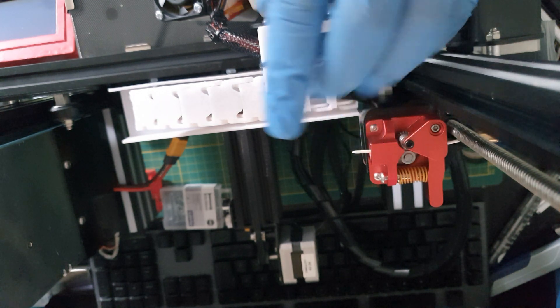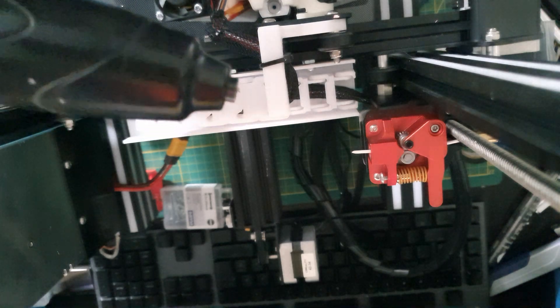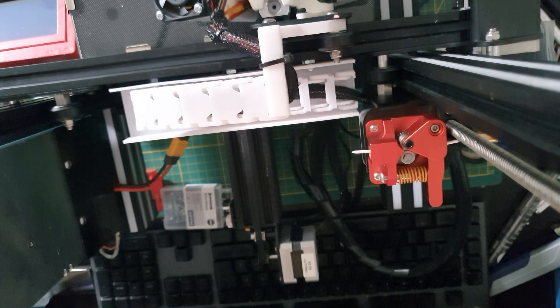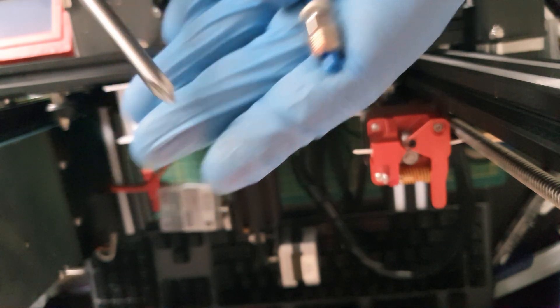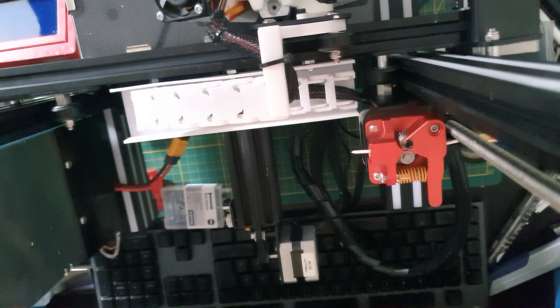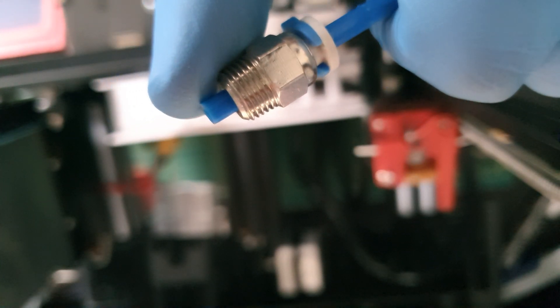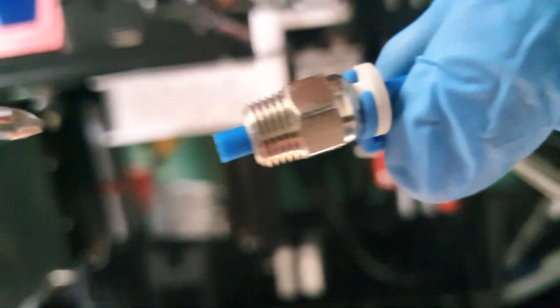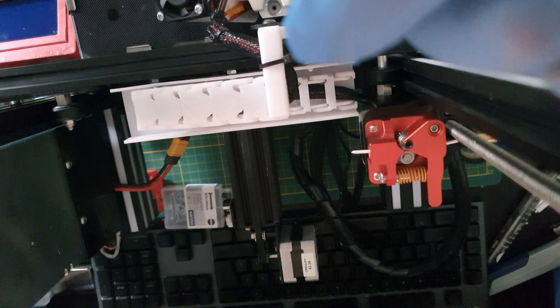Once those washers are in, that's that for that side. You will also need a little hand drill - you could use a regular screwdriver but the hand drill is way easier. You will also need a positive drive bit, quite a chunky one. What you will do is put on the clip once you've exposed about five millimeters or one-fifth of an inch of tubing, then spin your drill until it heats up the tip and ream it out into a funnel shape.